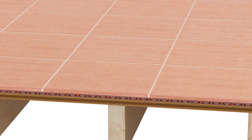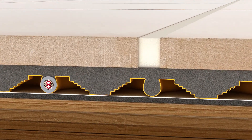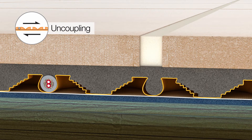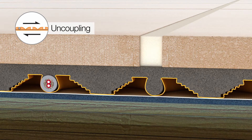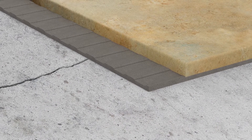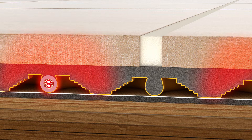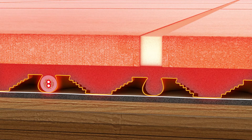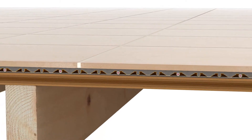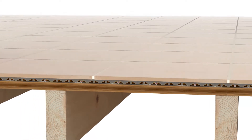Now we'll demonstrate the four functions common to DitraHeat and DitraHeat Duo. All floors will expand and contract with changes in moisture content and humidity at a different rate than the tile. DitraHeat and DitraHeat Duo provide uncoupling through their geometric configuration, which allows the substrate and tile to move independently. This prevents substrate movement from building up stress in the tile covering that could otherwise cause damage like cracks. Raising and lowering the floor temperature causes the tile and substrate to expand and contract at different rates as well, and the uncoupling function neutralizes the resulting stresses. Floors will also bend and deflect under load, and the uncoupling function prevents this movement from causing damaging stresses in the tile covering.